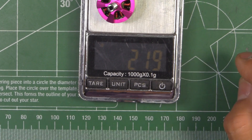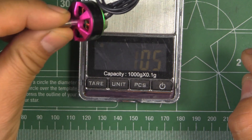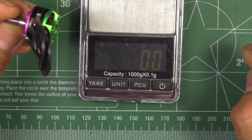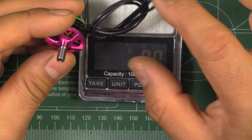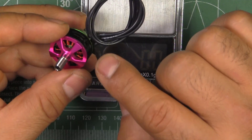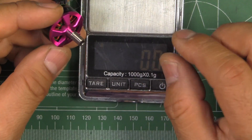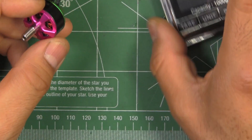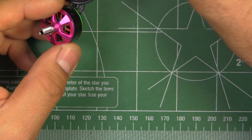That's really good weight for a motor this size. Most 1806s in the past would weigh about 22 to 23 grams, so they were actually kind of heavy. It didn't make sense back then — it was much better to run a 2204, especially when only 2300KV was available.